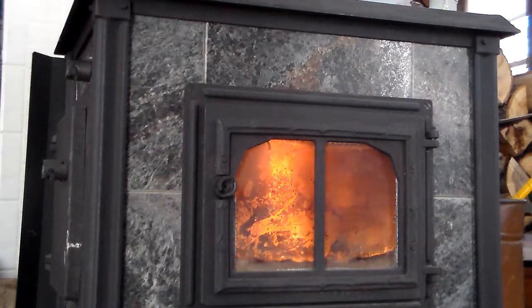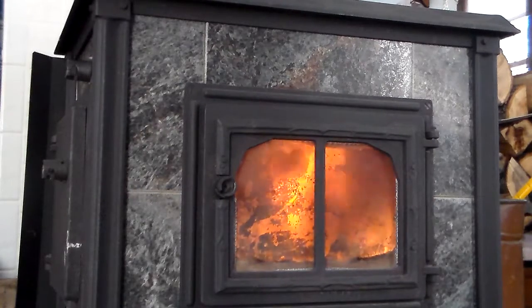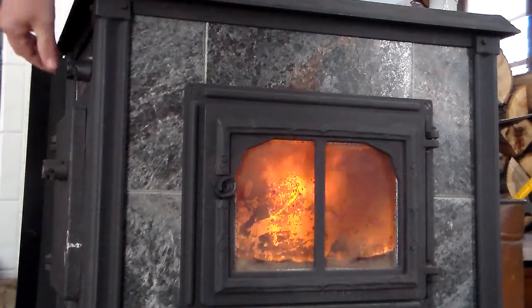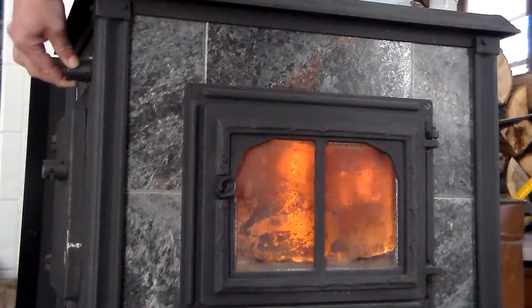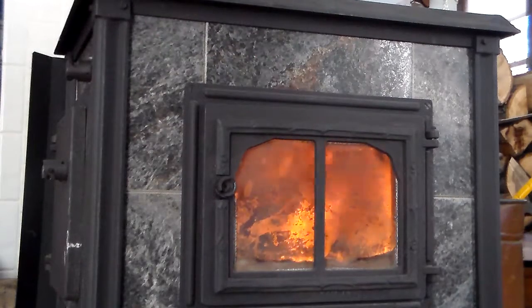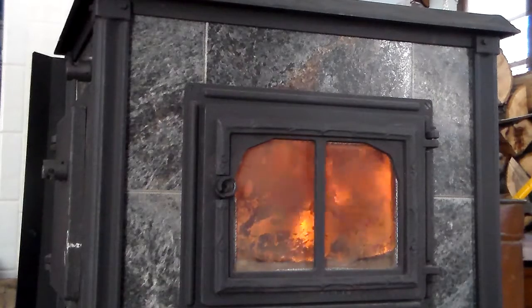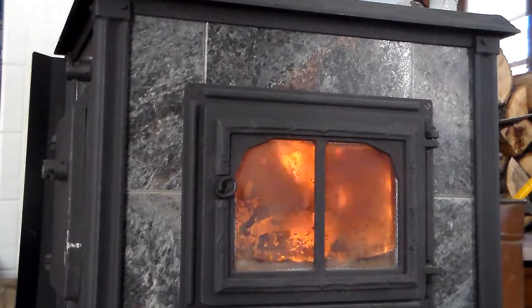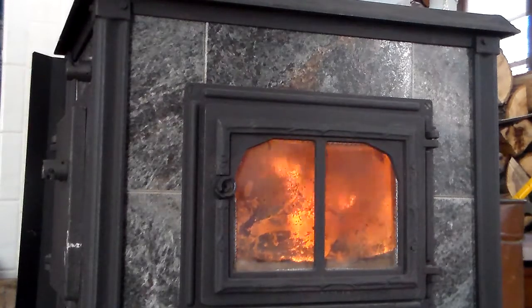Just checking back on our fire. Once you've confirmed good ignition on the wood, you'll want to go ahead and close off that damper. Now, this will not completely close it — it will still allow for the smoke to go up the chimney. However, it will allow for more of the heat to be retained in the stove and dispersed out into your room and the rest of your home. So, I hope you've learned something today and thank you for watching the How-To Husband.